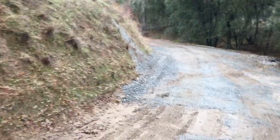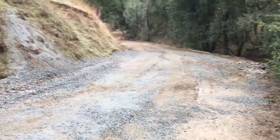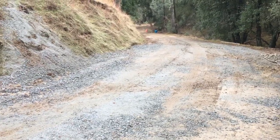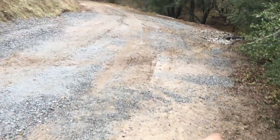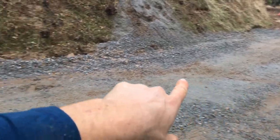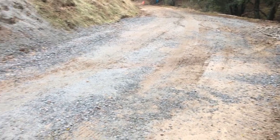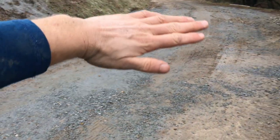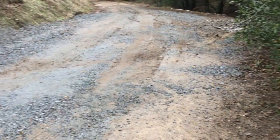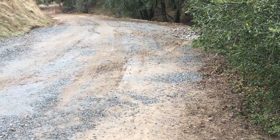It doesn't look like much from a camera, but this took about 10, maybe 12 to 15 yards of additional road base in addition to using all the material cut out of here. This drain is at about five to six percent, minimum, seven at the highest. We tried to keep it as even as possible so there's no sediment deposition from the inbound grade — no plugs — but we have a nice broad high bank here so that even if sediment does settle in the bottom it should be mostly self-cleaning as it heads down towards the rundown.